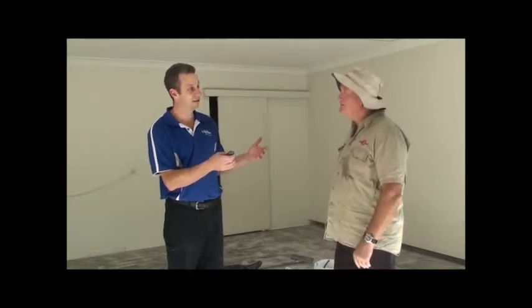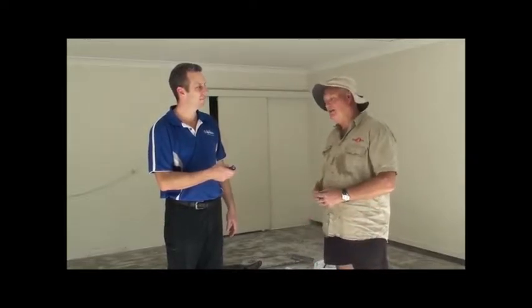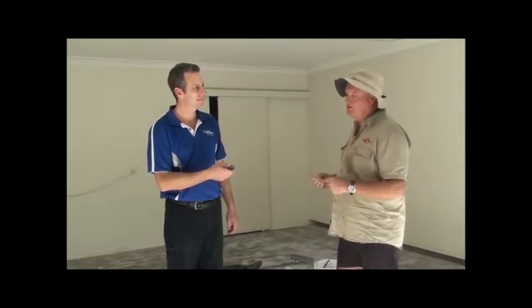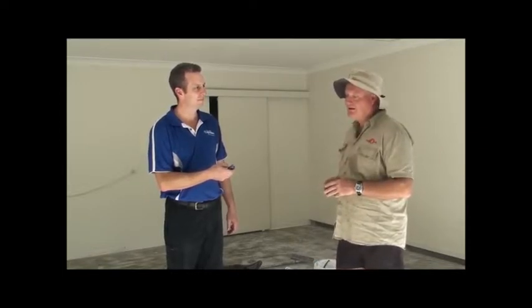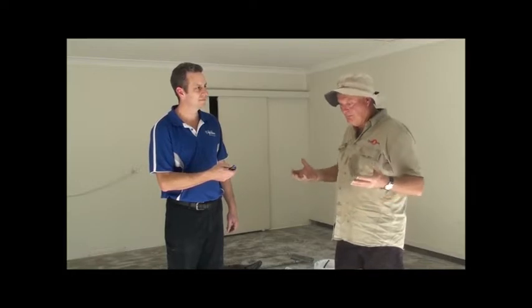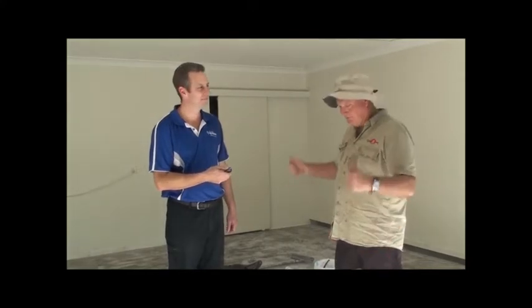Very good. And then tomorrow, when you come back, you actually recover a portion of the flake as well? We'll recover a portion of the flake. I don't like to use that in the next job. It's more there as a backup for a top-up if we're running a bit short, because each time we handle it, it tends to break up a little bit and pieces get a bit smaller. And I'm finding that with this system that we're using, we don't get a lot of recovery. Okay. It actually builds itself into the floor. Excellent. Good points. Yeah. Let's see how this goes.